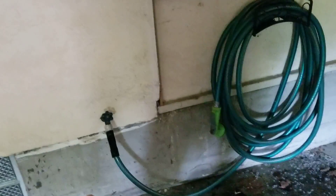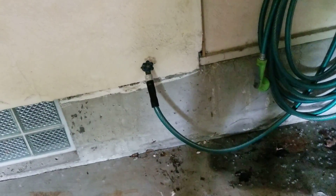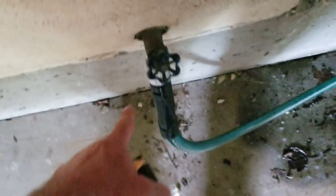The faucet — I turned the main valve off to the back corner inside the basement. The spigots need attention — these can be unfastened and have new gaskets put in. This one is off also inside the basement but this one may be leaking at the turn-off that's in the basement, so that's what's got to be done.